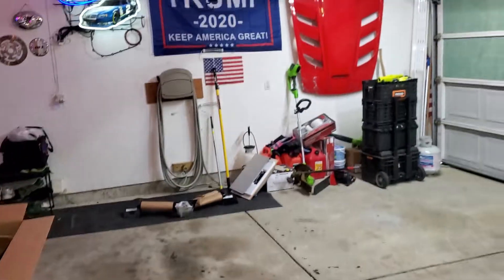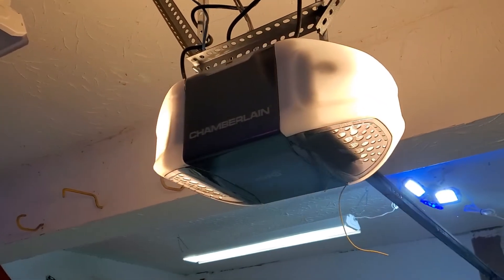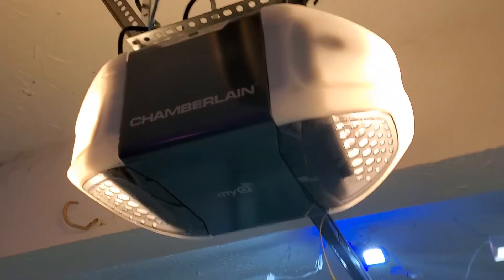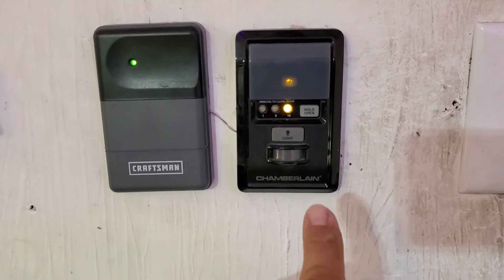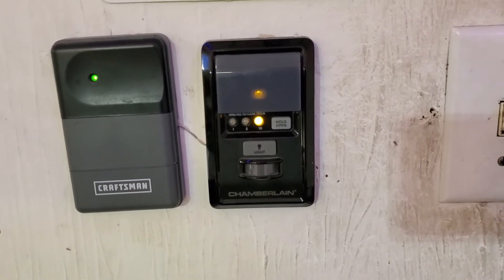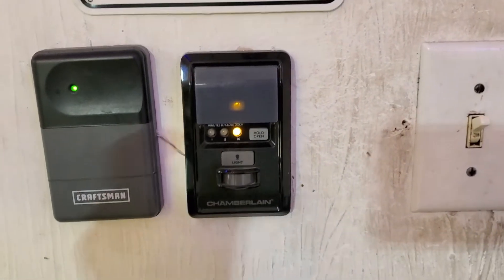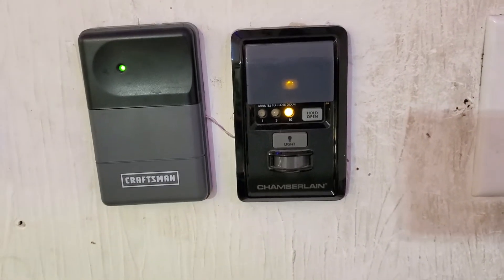I can simply take their wall switch — the smart one that also has HomeLink or myQ — and go directly to the button in that switch and do the same thing. They said no, it's iSecure and that's not a possibility. But right underneath that cover is a push button switch that just does a dry contact closure to the electronic board, which causes the door to unlock.